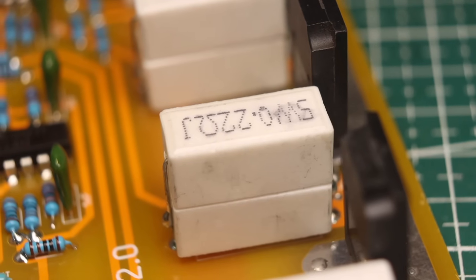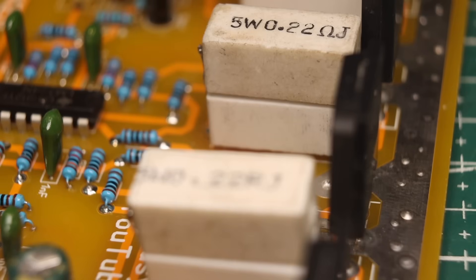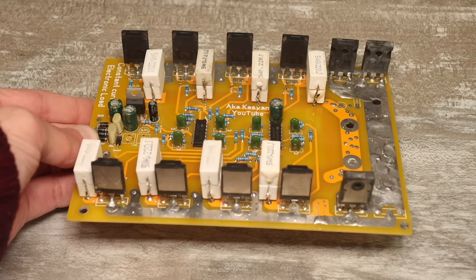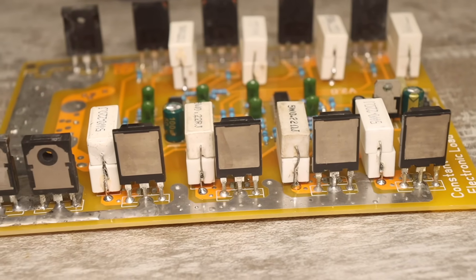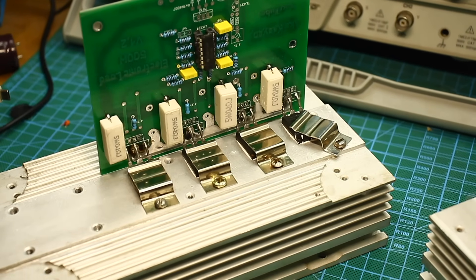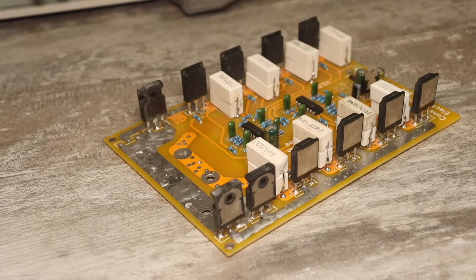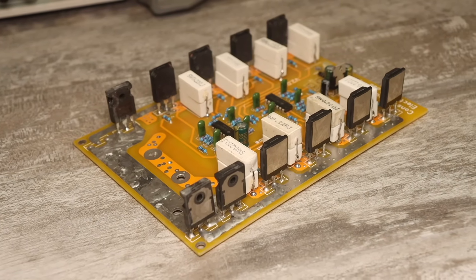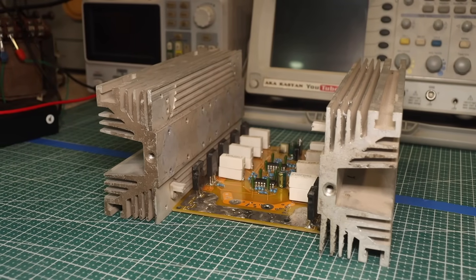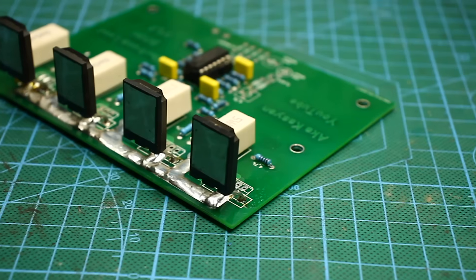The current sensors in my version are regular low-ohm resistors. Their resistance fluctuates depending on the heat, but in this case it's not that critical and doesn't significantly affect the operation. I used IGBT transistors in a Super TO-247 package, as I have many of them — a kind subscriber gifted them to me a long time ago. It's important to understand that the load power depends specifically on the type of transistor package. The load is linear, and that's good because it won't introduce additional noise. Absolutely all professional electronic loads are linear. The downside is that it's literally a heater, as all the input power is converted into heat on the transistors, diodes, and current sensors.